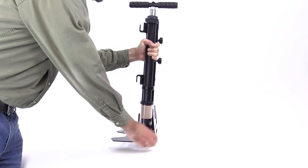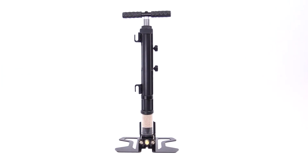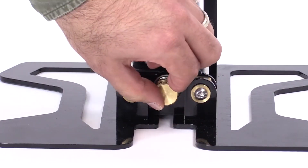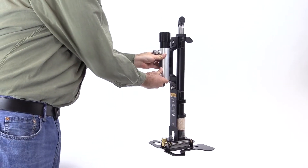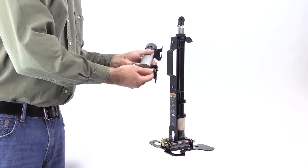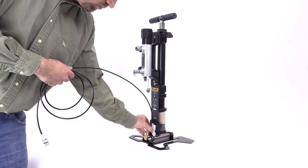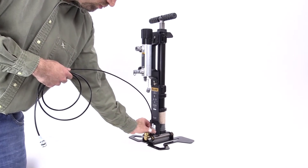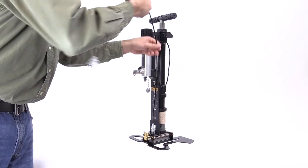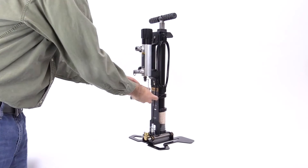Setting up the 700 HPPK is easy. Place it on almost any surface and open the legs to stabilize it. Make sure the vent valve at the bottom of the pump is completely closed. Connect the calibration manifold to the pump bracket — quick detent pins make the manifold easy to connect and disconnect. Connect one end of the first hose to the port at the base of the pump, then wind the hose around the bracket hooks and connect the other end to the inlet port on the calibration manifold.